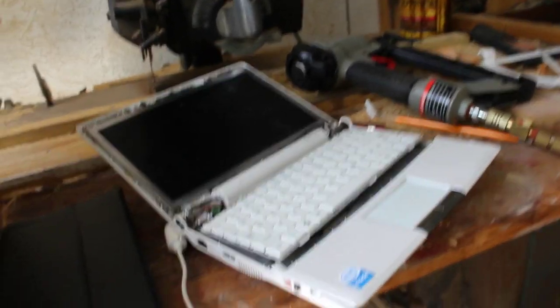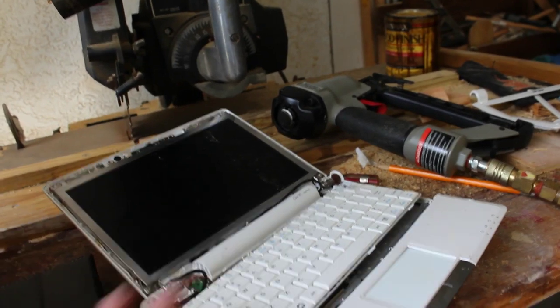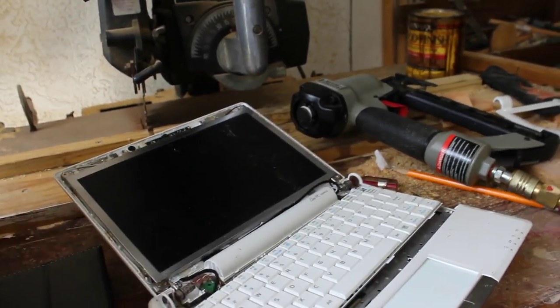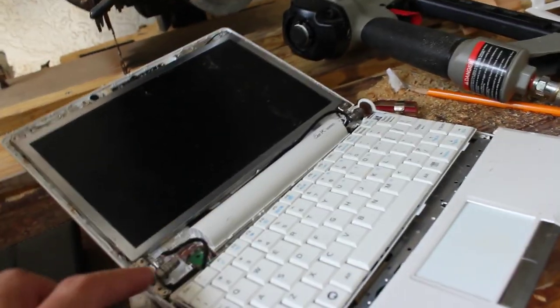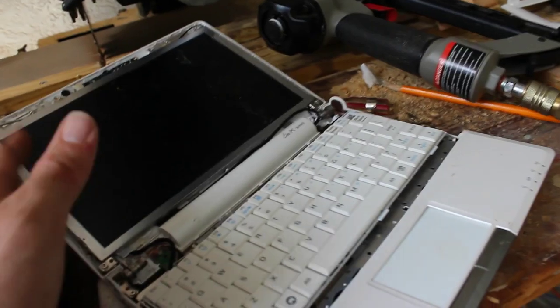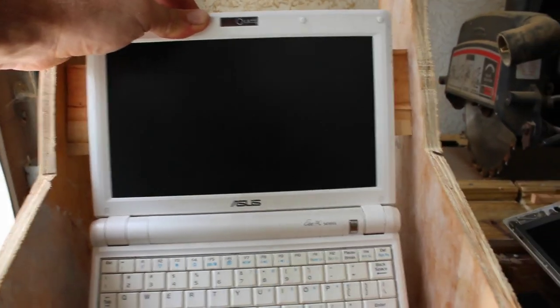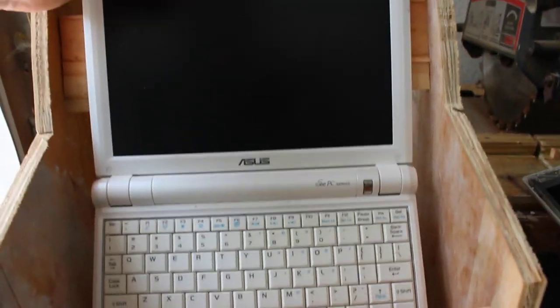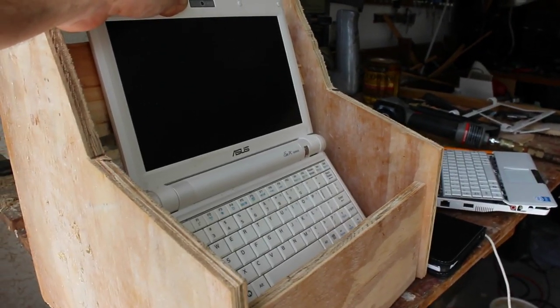Okay, first off, I didn't even test this thing out before I bent the screen back. I don't even know if it worked. These things did have issues. They would overheat. The hard drive went bad in at least one of them. So it probably was me bending it back, but I've taken it apart and the wires all seem good. The machine's definitely turning on, but getting nothing on the screen. Again, I tried putting the battery back in because I wasn't sure. Maybe it doesn't run without the battery, but that didn't help. Then I tried screwing the brackets for the screen back on, thinking maybe that was a ground that the monitor needed. Anyway, I still have another one, which I should test and make sure it works, which fits in there. I'm kind of forcing it a little bit to get the angle, and the keyboard's going forward, but it will work, I'm pretty sure.